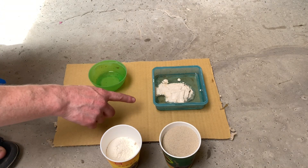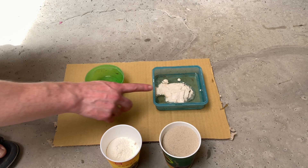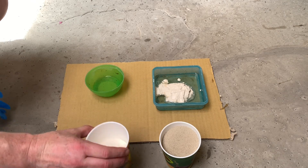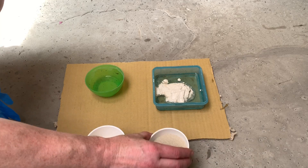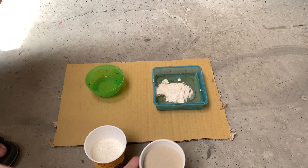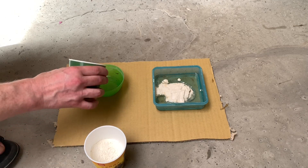So we've got a variety of things. I've got a bowl of some sodium silicate here. This is sodium silicate and lime putty. I've got some flour to act as an organic binder and some fine sand. I'm going to first try sand, sodium silicate, and the binder.